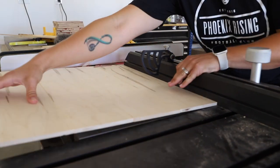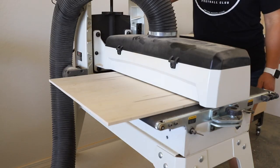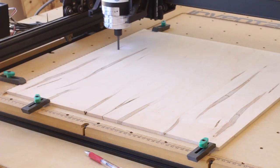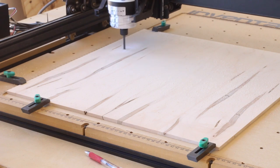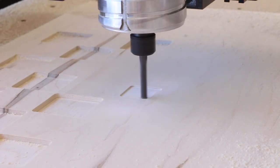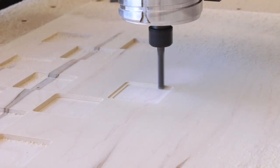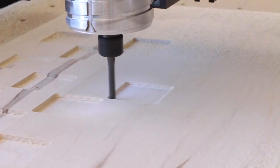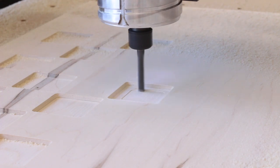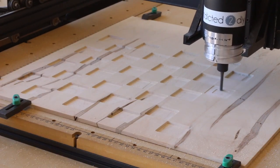The next day, I squared up the game board on my table saw, then moved over to my drum sander to sand the panel flat. I set the board up on my X-Carve to begin a two-stage carve, roughing out the checkerboard first. I designed all of this in Easel, and I've linked to all of that in my blog post tutorial, which you can find a link to in the description below. I used a quarter inch down cut bit to rough out all of the squares in the checkerboard. The two-stage process is much faster than using one single bit to do the entire job.